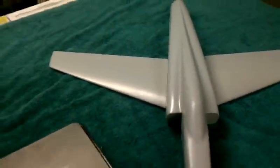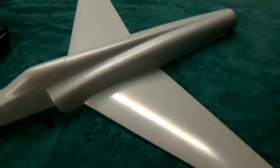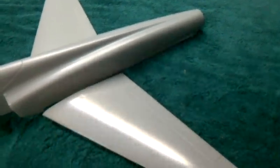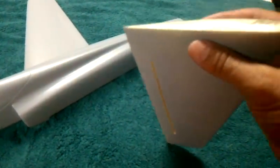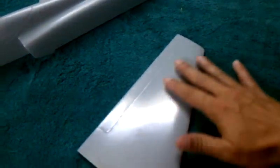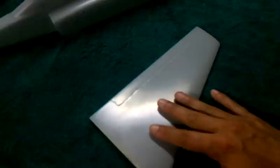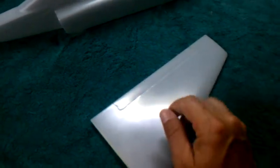After making this first prototype wing, I was discussing my options with my friend Troy Peterson, who's pretty experienced with molds, and we were brainstorming using expandable foam instead of using a vacuum bag and a core material. This is the first attempt, and here you can see that after the 1.5-ounce cloth had been laid in top and bottom, there was also a hinge material — a peel ply instead of the Kevlar on the other wing. Once the 1.5-ounce fiberglass tacked up, we joined the mold and poured in the expandable foam.